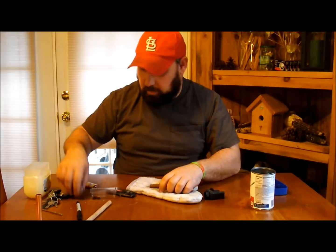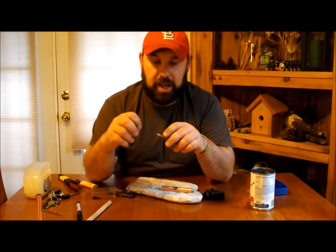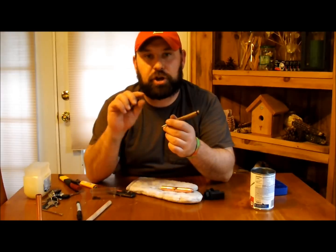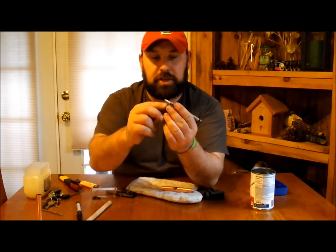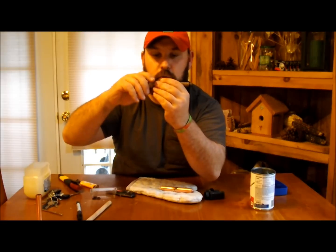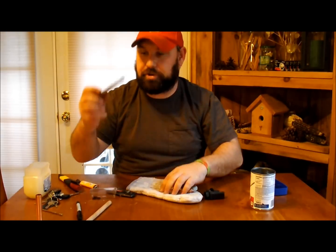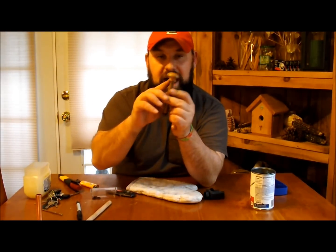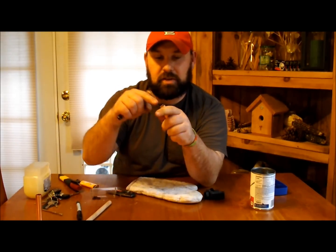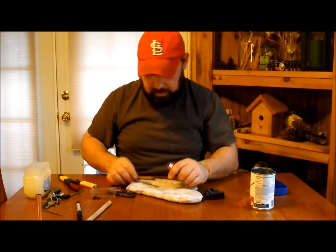So then I took my handle. These come with a screw. You screw it in, and you're going to take the screw head and you're going to grind that off on your grinder. Then you're going to drill a hole, and you're going to put this all together, and you really want it all to come together flush. So when you're done, the bottom of this will rest on this only by force. You have to force it on there. All right?